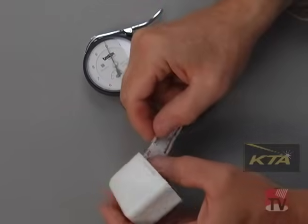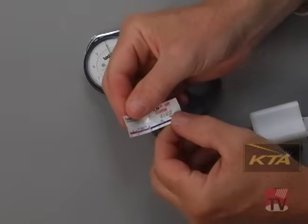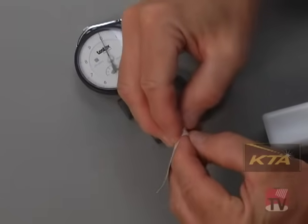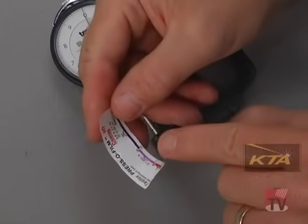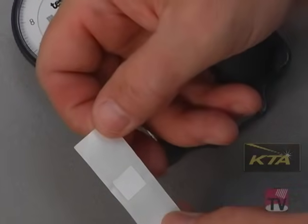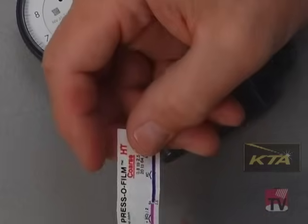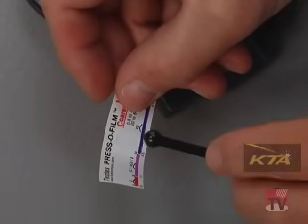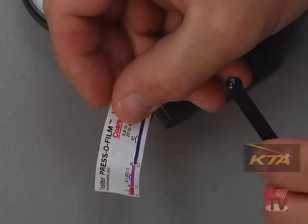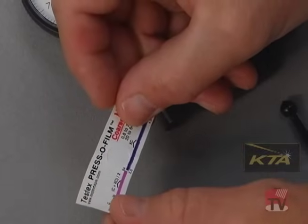Before I demonstrate it, I want to describe the tape. There are a number of tapes available. The tape itself: we peel the wax paper backing off the back, and it consists of a 2 mil thick film of mylar in this circle. The back side of that mylar is an emulsion of microscopic bubbles. When I put the tape on the surface emulsion side down and rub the back with a burnishing tool, I'm actually breaking the emulsion — the bubbles — by the peaks of the profile, creating an exact reverse replica of that profile that is then attached to that 2 mil thick film of mylar.